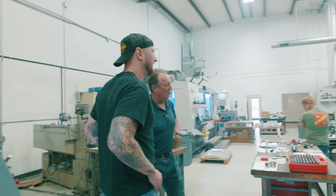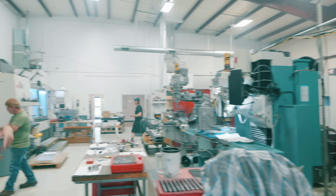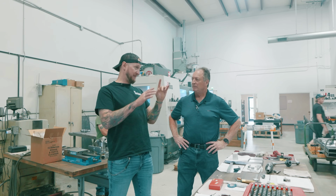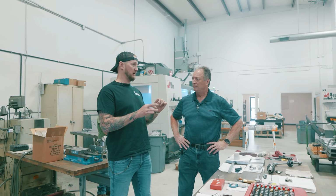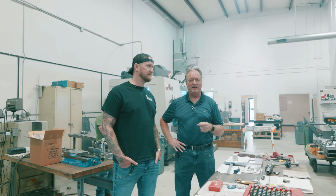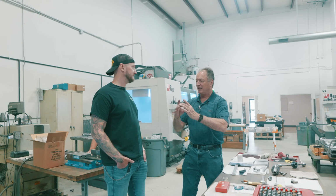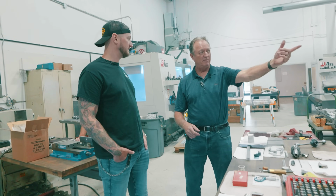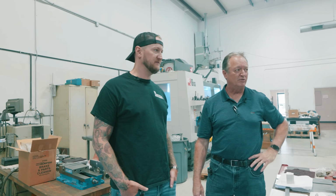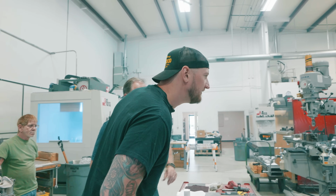This right here is one of our latest. This is actually our latest machine. We had an old 94 track machine, and this one is full 3-axis. Apparently, you can program G-code, but you can also program strictly conversationally. This one we had equipped with a DXF translator, so I can take customer-supplied DXF prints, put them on a disk, put them in, and he can program directly from those, right at the controller. He's doing things he never could do before, and it's almost automated.